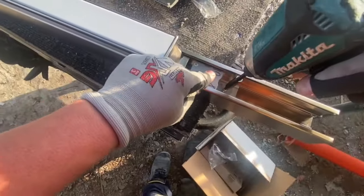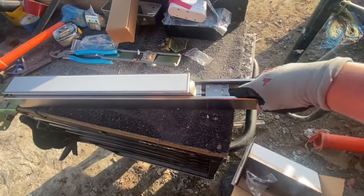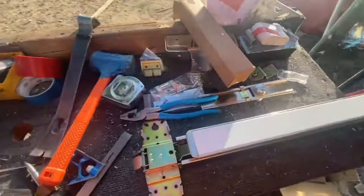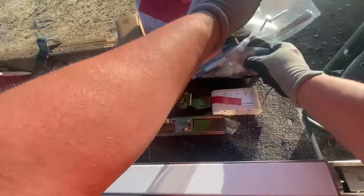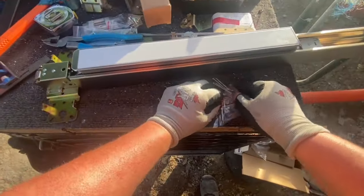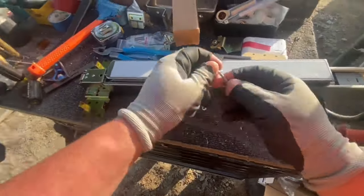And so this video is just going to be covering the mechanical portion of this, not the programming and commissioning or startup of the electrified part of this lock. We're a little bit early on here. We're just getting the door lockable for the customer, and see me put the magnet on that door there. That's going to hold up the end of the bar as I get it started. Gives me an extra hand over there. They got these long screws with washers, and that's what I'm going to start with. And I'm going to start by just getting one screw in.